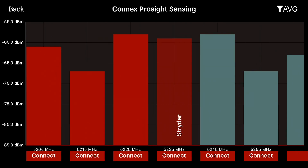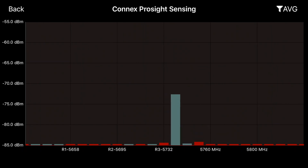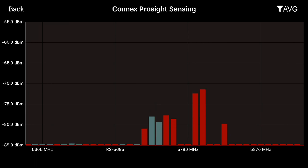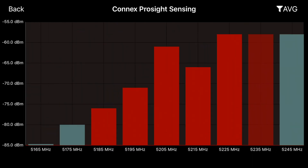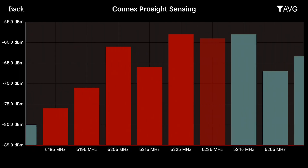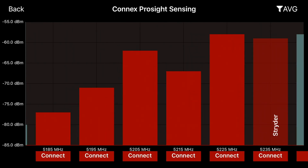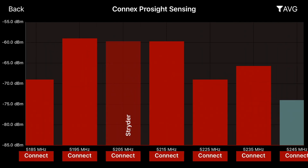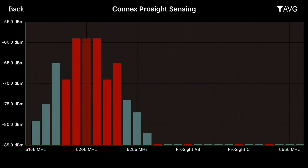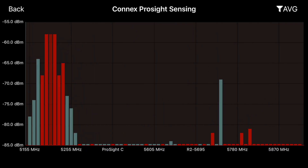It's just me sitting here with my Strider plugged in, so you can see as I zoom in it'll show you all the individual frequencies that you can use or choose based on the color coding. It'll show you what machine you're on, and I believe it will show other machines as well if there are other machines active. If I scroll over to the right a little bit we're seeing some bars jumping up and down — you're basically looking at the Wi-Fi network in my house. Now if I wanted to change frequencies, I look at the available frequencies, click on 5205 as I zoom in all the way, hit connect, hit master, and I can look at the new frequency that it's been selected to: 5205. It shows the spectral content of all the frequencies — you can see the signal is strongest on the center frequency and then tapers down on the sides.